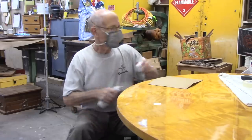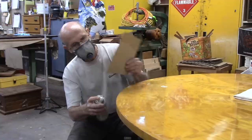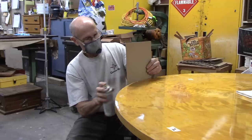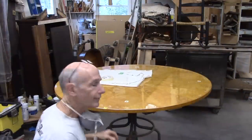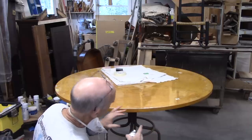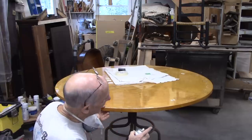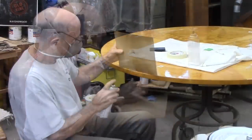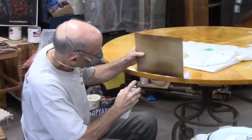I'm going to take some light golden oak aerosol toner and go over this entire edge — I think that will really pull it all together. That was definitely a good move. Some of these areas I may hit a second time. I'll let this dry and check it again where necessary. It's really looking good now. I've let the golden oak dry for about a half an hour, and now I'm going to spray it again with clear gloss lacquer.